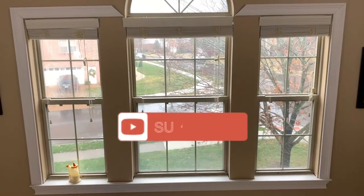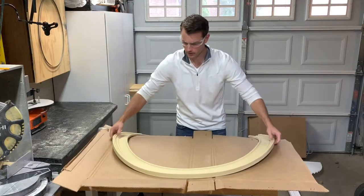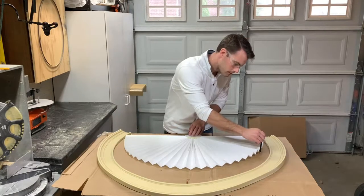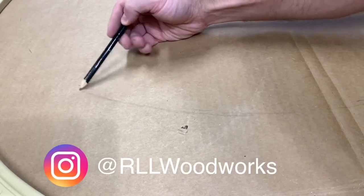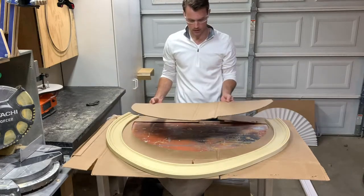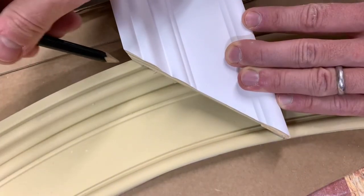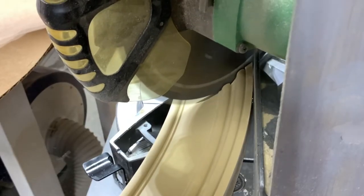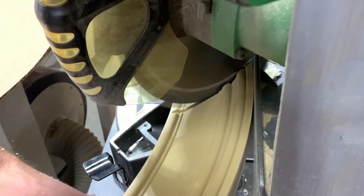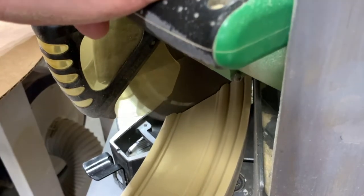This was a good time to break for lunch because the next part is this arch, which is something I've never tackled before. I ordered this product from FlexibleMillwork.com — they have a very easy ordering process and I'll link to their website in the description. A flexible arch is not the easiest thing to measure and cut, so I used the shade to make a cardboard template of the window. The arch doesn't have a flat side to reference, so I used a scrap with a 45 degree cut to mark my line. Not having a flat side to put against the fence also made it challenging to cut on the miter saw, so I took my time slowly moving the piece with the blade following the scribed line. I'm sure there's a better way, so let me know in the comments.